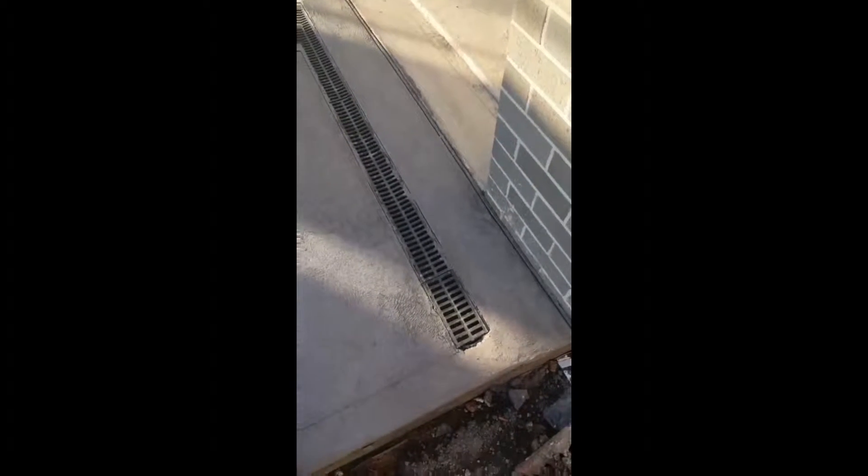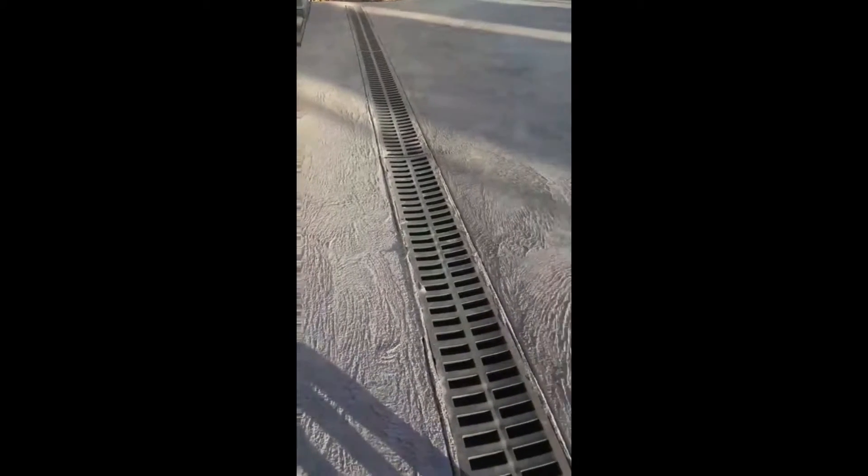So what's been put here is a grate running all the way across the garage to catch all the water. If you look at it, it all falls down to the grate, and then just this little part here they make this just slightly fall back to the grate. So this creates a little bit of a gully here, so all the water goes straight into the grate.